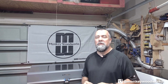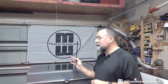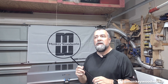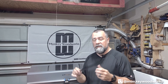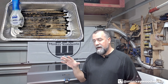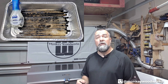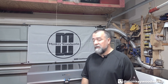Those are the steps I use when I clean my P2. Hopefully you found this video useful. I almost forgot to share what the Dawn Power Wash is for — that's for cleaning your slats at the bottom of the P2. Alcohol does a good job of cleaning and you can wipe them down for a quick wipe, getting the lighter stuff off, but the oils and sap that's been there a while are really hard to get off with just alcohol. Vinegar also works but doesn't cut as well as Dawn Power Wash. What I'll do is put all the slats in the pan, spray them with Dawn Power Wash, stir them up a little, spray again — you'll see it starting to come off right away. Let them soak for five or ten minutes, then take them outside, rinse with a water hose, and let them dry. That does a really good job of cleaning the slats.